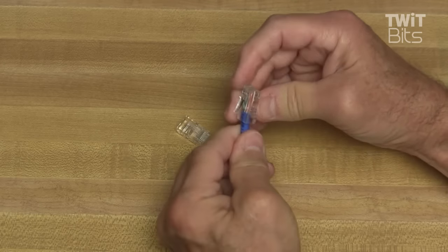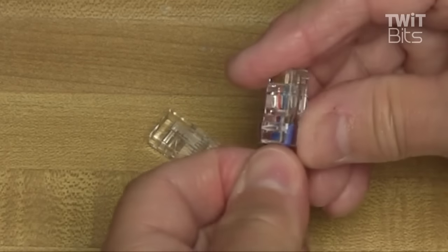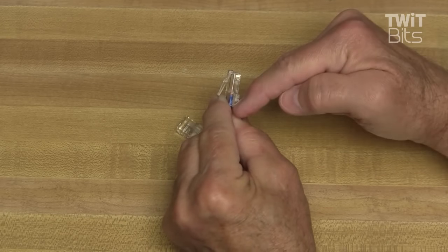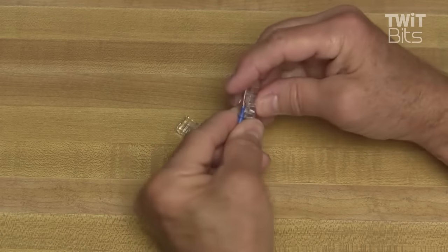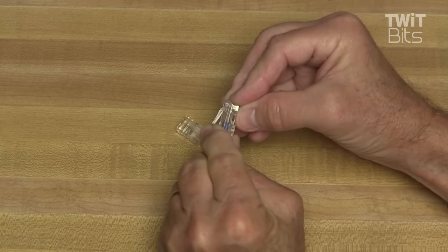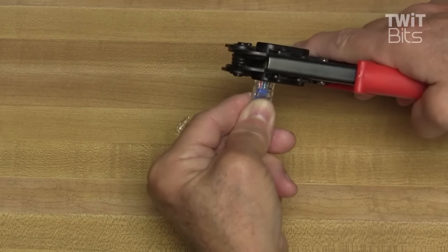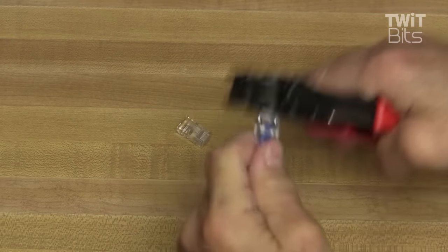Slide them up into the connector and check to make sure on both sides that the wire goes all the way to the end. When we crimp it, this little pin right here will fold down inside the connector. We want the insulation to go far enough in that this will crimp into it. Now we'll push the wire up in hard — we started out with three-quarter inches of stripped cable, but as we push the jacket up, that's become shorter. Next, we'll insert this into our crimping tool, keeping pressure and pushing the jacket in. Crimp the wire.